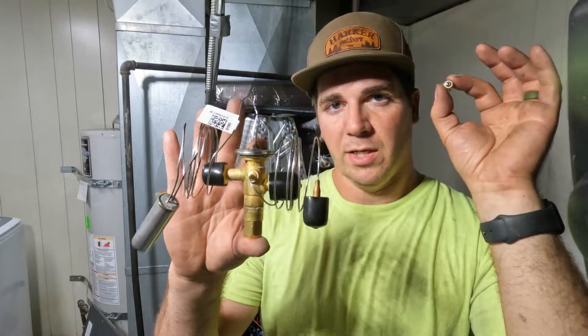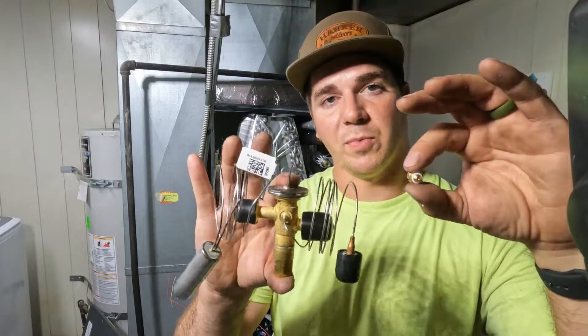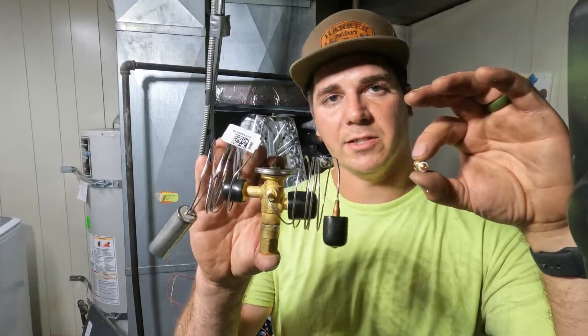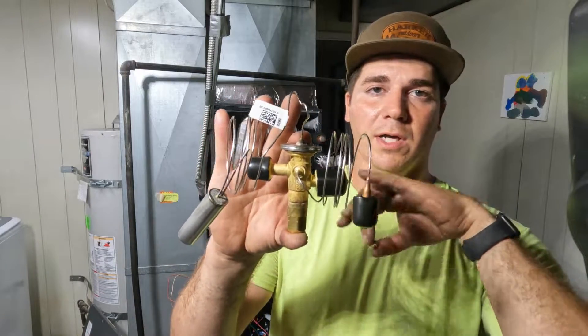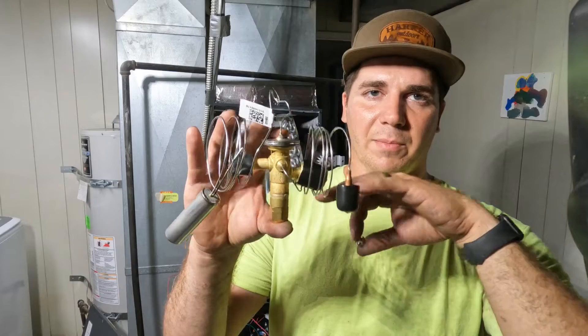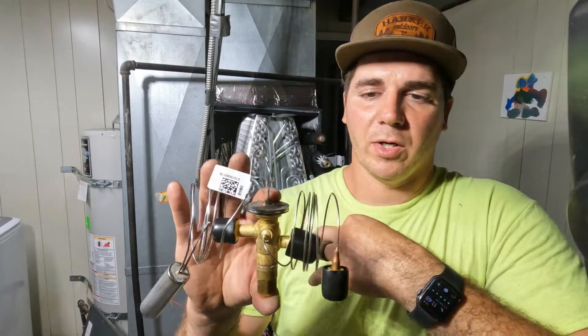it might not be as efficient, but it's just a hole — just a piston with a little seal and a cone and a hole, and that's all it is. So in some respects, I like the piston better, but people want to have a more efficient system and we install these TXVs. So those are your basic principles behind these two metering devices. In the next video, I'm going to show you how to install this TXV. It's a universal — it can be installed on pretty much any evaporator coil.